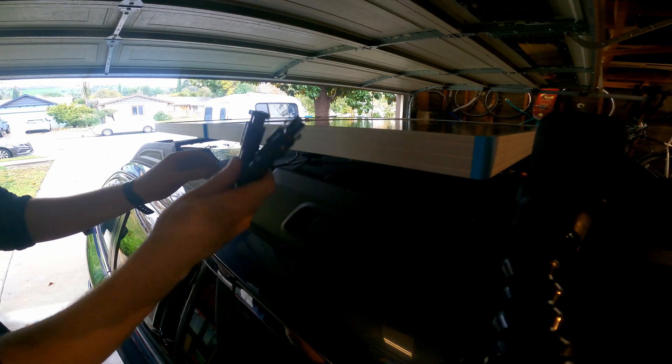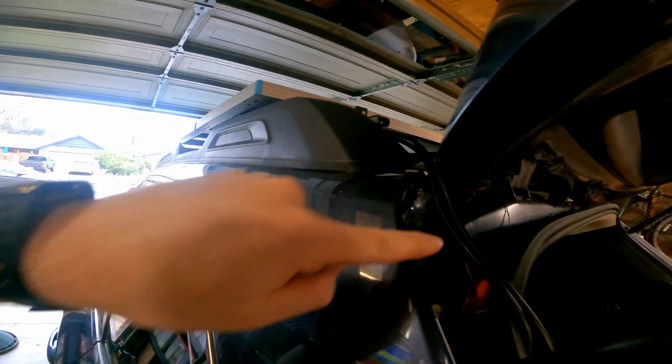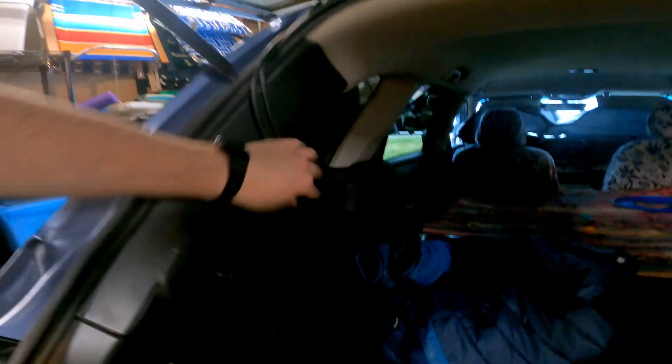I have these adapters — we're connecting these in parallel. I cleaned up some of the connections under there and it looks pretty good. This is it, it's pretty clean. The wires just come in through right here and then those go to the charge controller.